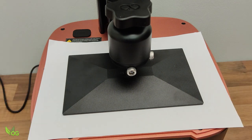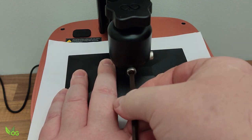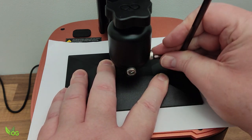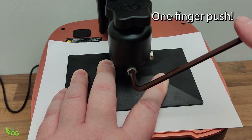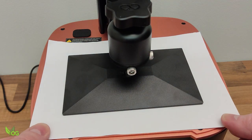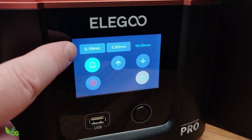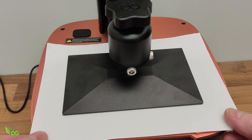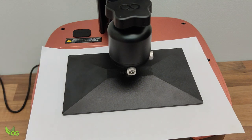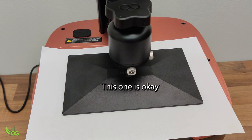Carefully straighten the plate so it's nice and square — I'm using this edge as a visual guide. Perfection isn't necessary; just do your best. Then press gently but firmly, ensuring the whole plate is flat against the screen beneath it. While still holding, tighten the bolts lightly at first so that everything beds where it needs to be, then revisit and tighten fully — though no more than a finger push is needed. If you overdo this you can damage the threads. Release the plate and pull on the paper; it should now be held in place quite firmly. If you can barely move it, select the 0.1mm setting and click the up arrow once to raise the plate a small amount — it should then feel firm but you will be able to pull it. If it moves loosely one side but grips tightly the other, something has gone wrong and you'll need to start the process again.